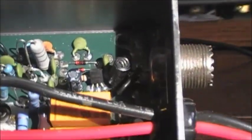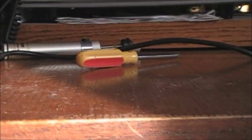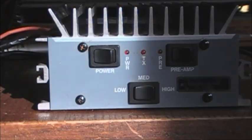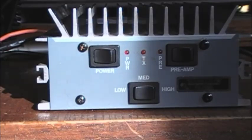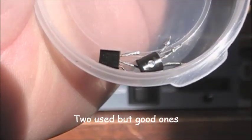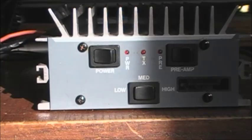There's one right here, and opposite the board you can see the other one right here. These are 3904 transistors. I'm just going to go by this gentleman's opinion that I should change out these two transistors and solve that problem. I just so happened to have looked through my inventory and was very fortunate to find two of these transistors. They're identical — I've tested them and they are working fine.